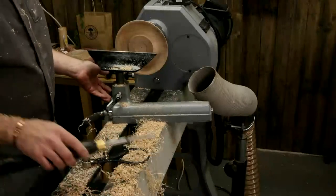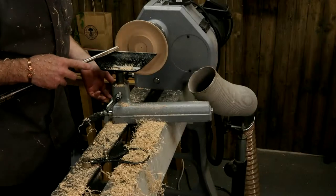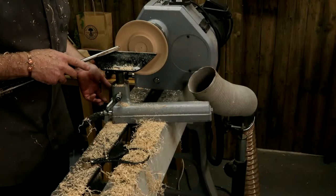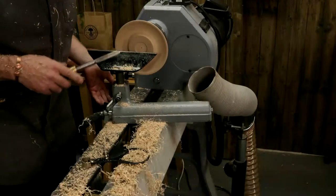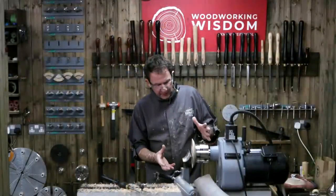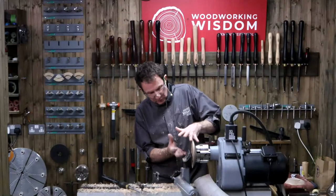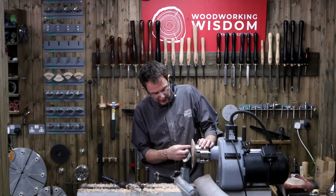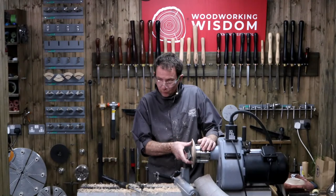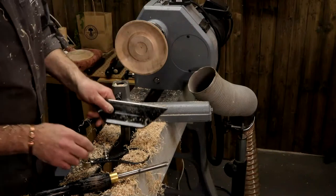Now at this stage, and this is weird, now this is a piece of air-dried sycamore. We're getting a bit of bounce. And I'll tell you, this is one of these common questions. Dave, just watch me cut it. It was nice and clean. So why are we getting that bounce? The grain's starting to shrink across the grain. Wood fibres are reacting to what we've taken out. So actually, this has come in a little bit and grain will be slightly longer. So it can cause quite a lot of issues.